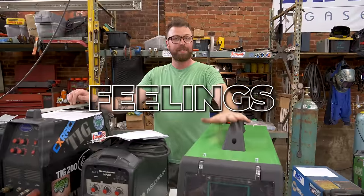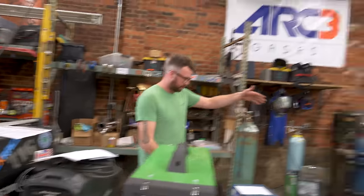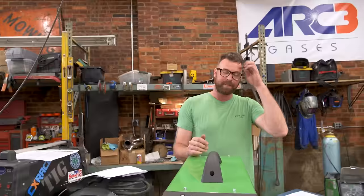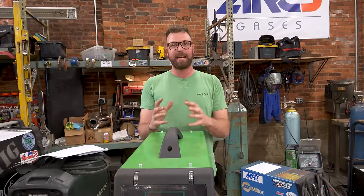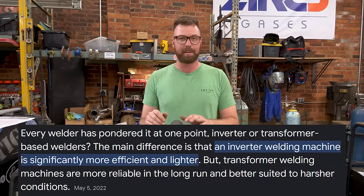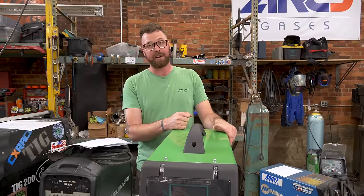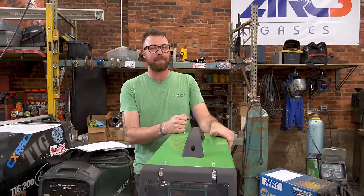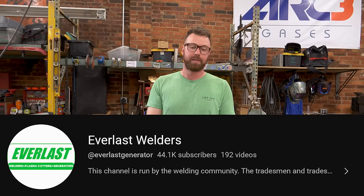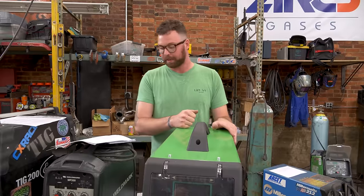Overall feeling and conclusion: very powerful inverter machine. All of these machines have been inverter machines versus transformer machines. The difference is size and power technology — transformers are giant heavy layered metal and copper wire coils; inverters can be a lot smaller and achieve similar power profiles. It's the most powerful MIG welder I own. The instructions are a little vague, but Everlast has an incredible YouTube channel, so what they lack in paper instructions they more than make up for in tutorials. Power set doesn't work, it spatters until you understand inductance, and contact tips are cheap but it didn't come with many.